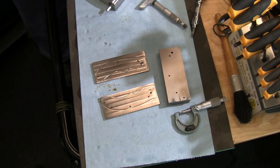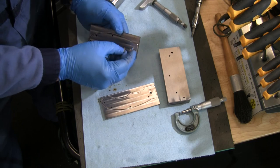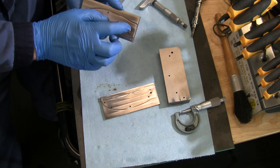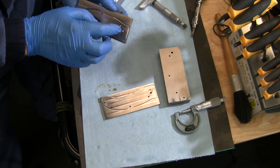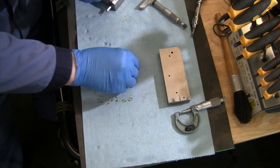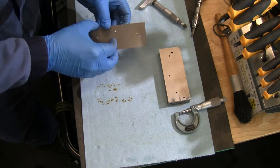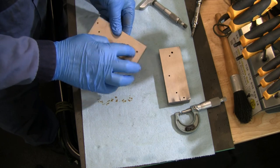And for the 1/8 holes, so for these ones, I used to ream them. I found that that carbide drill does well enough for me. Yeah, that's good. It's a snug fit, but just a little bit of friction through there, but it goes. And we seem to have a good match one side to the other. We'll find another one of those. Okay, we've got good alignment. So quality-wise, I think our program is good.